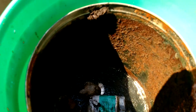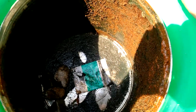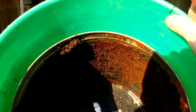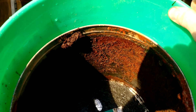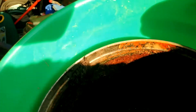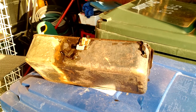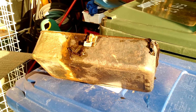I wanted to show you the tin out in the sun — it is completely rusty, and that's why I call this sacrificial metal. The tin takes all the rust. The piece with the positive battery cable rusts up really bad, and the piece with the negative cable cleans up really, really nice. So that's all there is to the process. It's pretty simple, straightforward, and pretty cheap.